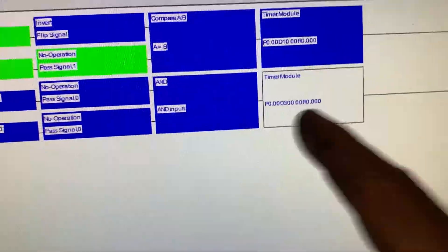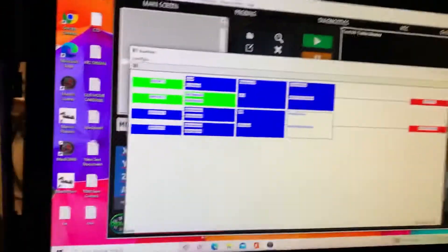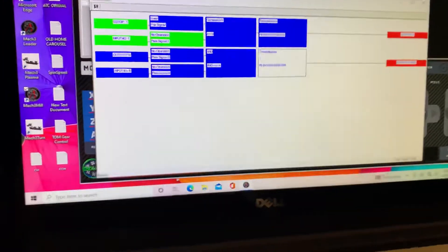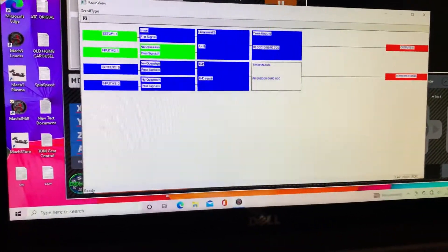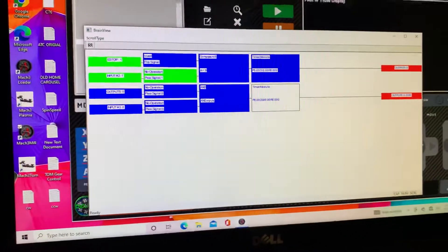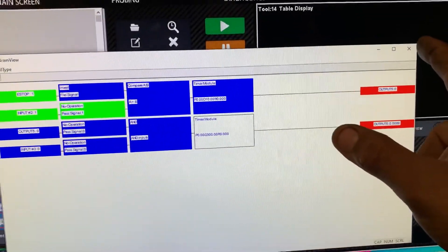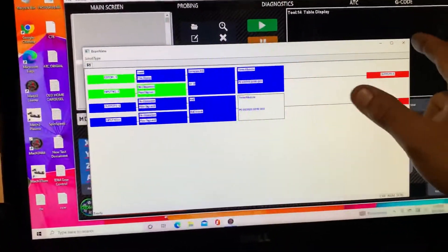After five minutes, my compressor will come on. So let's say I just hit my e-stop and sometimes you just want to jog the machine — your compressor doesn't have to come on right away. In my case, I don't want it cooling down for no reason, because it creates pressure and it's hard for the compressor to start. I'm just using the blower. If I stay longer with the e-stop than 10 seconds, after five minutes the compressor will come on if the machine is still running. That's how I run the cooling system on this machine — it's pretty much a full AC system.